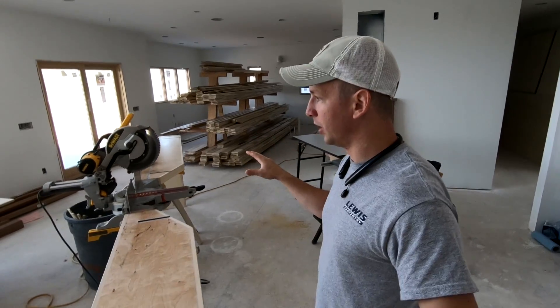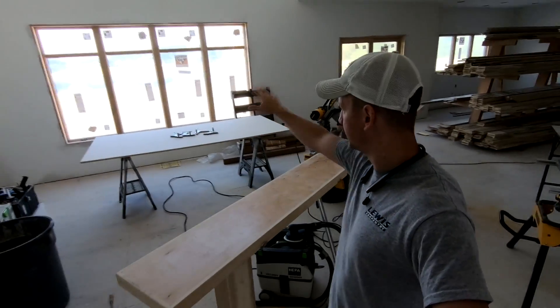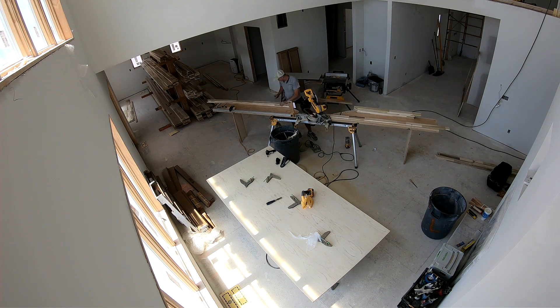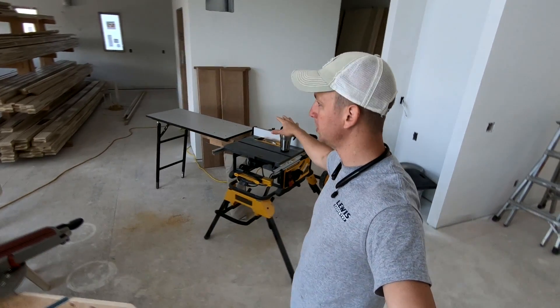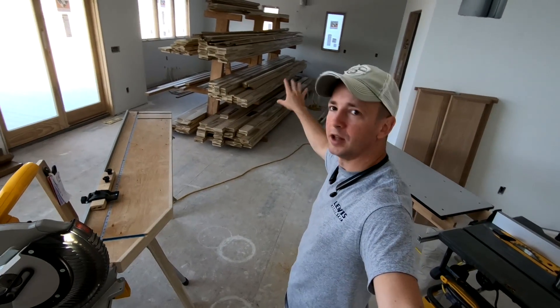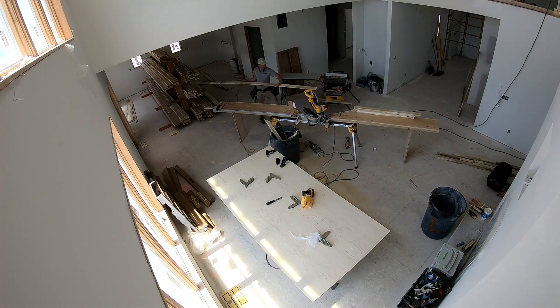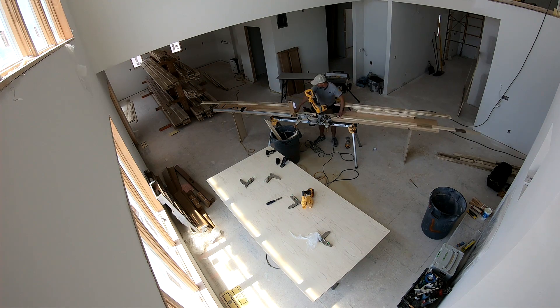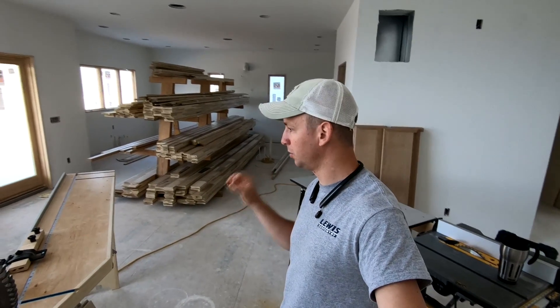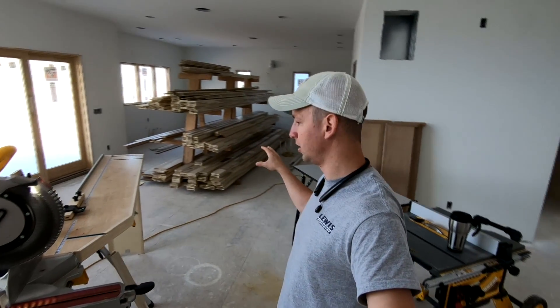The first thing we got to make note of is the setup that I've got here: assembly table, miter saw, stop block — very important. I have my table saw behind me. I like to put my table saw behind me because I can stack trim on it — it's just another table to put stuff on. And then probably most importantly over here is my trim rack. That bay right there is all casing, so I can just pull it right onto my saw. Making money in production trim work is all about efficiency of motion — doing things with as little movement and as few footsteps as possible is extremely important.